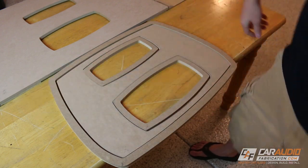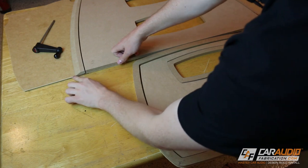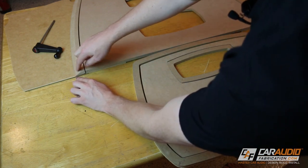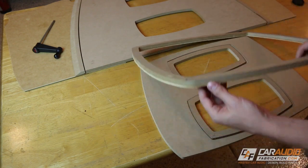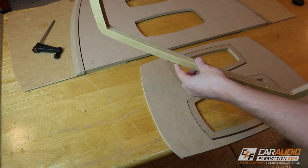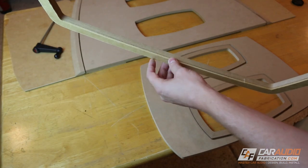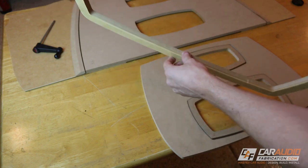And if you guys remember from my previous video on this guy right here, I actually did this cool little trick where I use a sacrificial piece. That way this point comes all the way down into that surface. And I'm gonna be doing the same thing with this here. And what I've actually already done is there's a separate piece stuck to it here. And that's gonna serve as my sacrificial edge. That way I can maximize the cut of the chamfer.